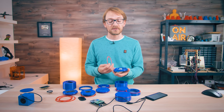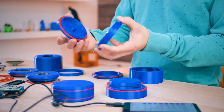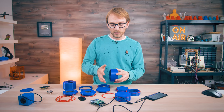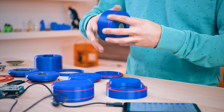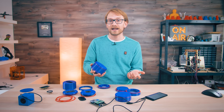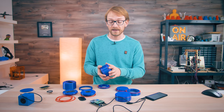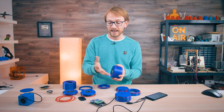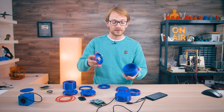I also wanted these parts to have minimal non-3D printed components. The seals are just a flexible material, the main bodies and blue parts are 3D printed — this is Filamentum Royal Blue PLA — and it's got 3D printed threads, so both male and female threads are completely printed. I also wanted the size to be practical: a good enclosure that's not super tiny but also not so large that printing takes days and several spools. These are about 500 grams of PLA in total, and they're comfortable to grip for anyone, including 12-to-16-year-olds in a workshop setting.